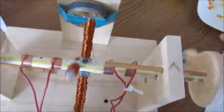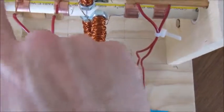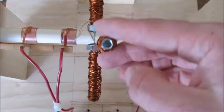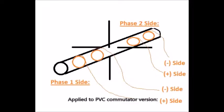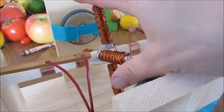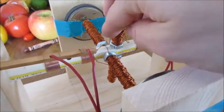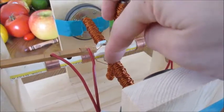One consideration is that as this thing is spinning, nothing can impede it — the chopstick can't go all the way across because it would block the rotation. If you wind clockwise on one pole and go to the next pole, continuing the same wind would be counter-clockwise. Clockwise, counter-clockwise, counter-clockwise — the only way to do that on one pole is to switch directions at the halfway point.